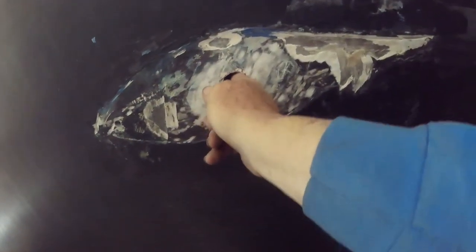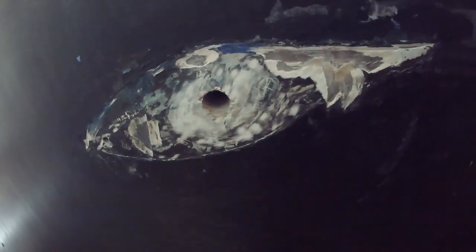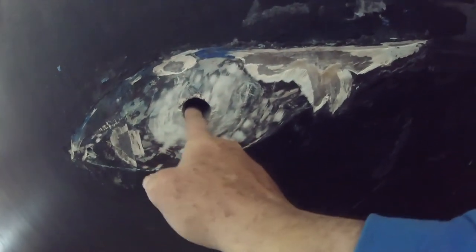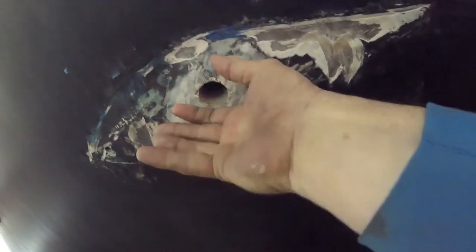Because it has to squeeze down, it can't squeeze down on a foam core. So we're actually going to drill a hole much bigger than the stem, and then fill the whole thing up with resin and chopped fiberglass. That will seal this whole foam core so that we get no leaking into the foam and no ability to compress it when we tighten this thing down. After that's filled and cured, we'll drill another smaller hole, which will equal the outside diameter of the cable gland. We don't have to fair the cable gland like the transducer has to be faired to go straight. It's all hollow on the inside of the fairing block, so the cable gland will just fit up flat there, at an angle inside the inner hole of the fairing block.